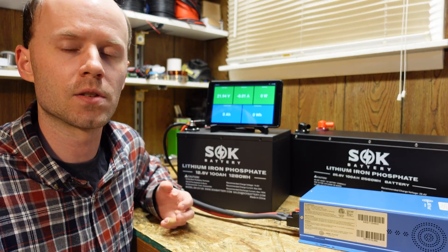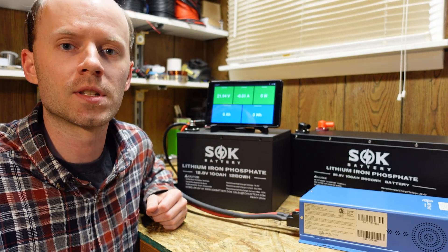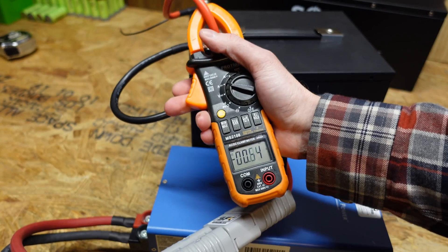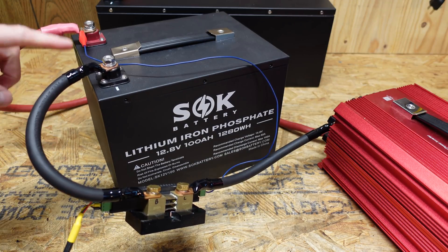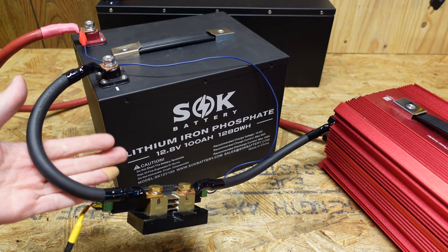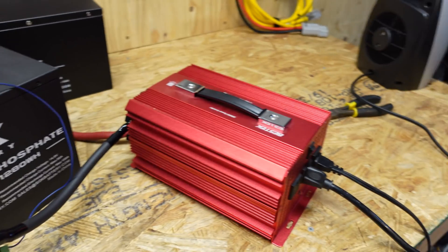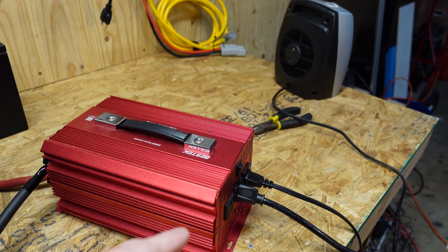I'm going to watch that test very closely and as soon as it cuts out, I'm going to open up the battery quickly — you can see I've already got the screws removed — and we'll use the FLIR thermal camera just to see how warm it is inside. The battery has completed charging. Since this is a higher amperage test, I did make some shorter and thicker cabling from the battery to the inverter just to reduce the overall voltage drop across the cable. These are 1-0 cables on both the negative and the positive side. Other than that, it's pretty much the same: the same Batrium shunt, the same inverter, and then I have my space heater for load in addition to the incandescent light bulbs in case I need them.